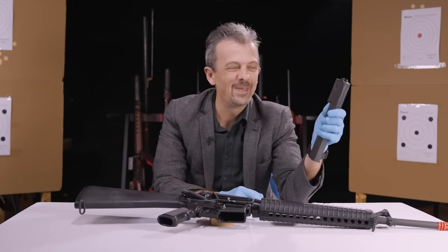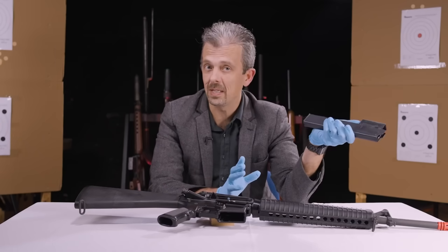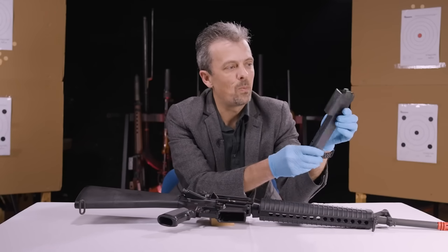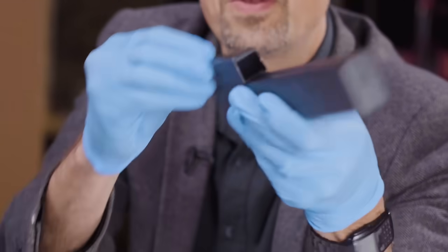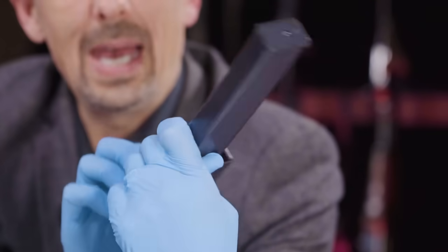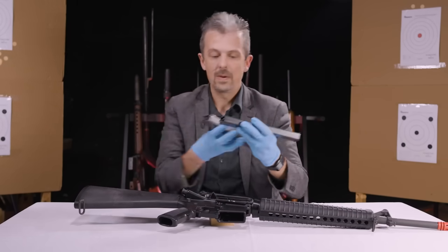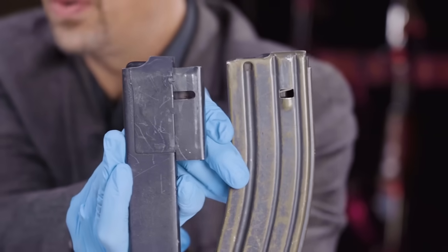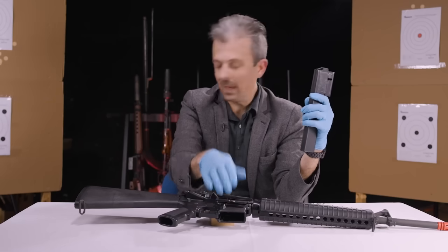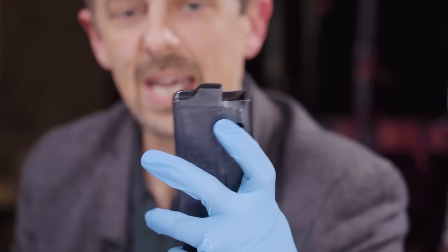So this is an AR-15 pattern rifle with a Sten magazine in it. I had to, of course, get to the bottom of why that is. Some of you, especially in the States, might already know. This magazine, looking at the top, has had tack-welded to it this reinforcement that makes this portion of it very thick. The sides are just thin sheet steel, and there is an added-on cutout here. That lines up with the equivalent cutout on an AR-15 magazine. The mag has been made deeper in order to fit the magazine well equivalent to the AR mag, and it's had a cutout so that the magazine catch can engage and keep it in place.